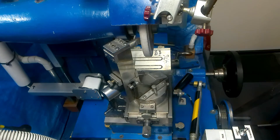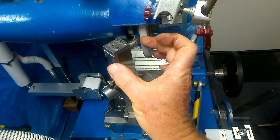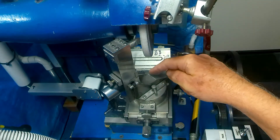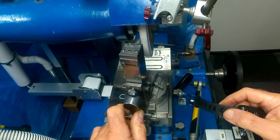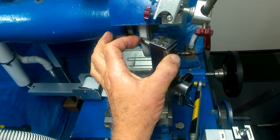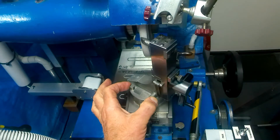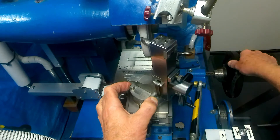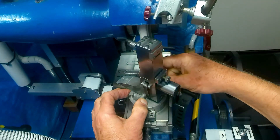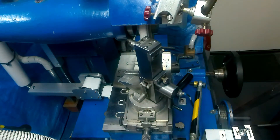This is the first time I've taken it out of the box so all I've done is had a quick read of the instructions. From what they say, to set the radius you only need a micrometer. You basically measure this distance with the micrometer and then down on the other side there are these two pegs — it's a combination of knowing what this distance is, then measuring it down there, and they give you a chart. Then it's just a case of sliding this in and out to get the distance you want. It sounds quite easy to use.